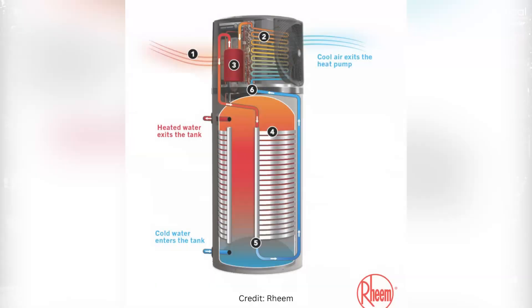A heat pump basically has four cycles. We've got a room-temperature refrigerant that goes into an evaporator — it goes through a tiny little hole, almost like squeezing an aerosol can, it gets really cold, and it gets warmed up by passing through a radiator, and now it's at room temperature. It then goes into a pump and gets compressed back into a liquid — that's a really hot liquid, a bit like if you've got a bike pump and you pump it up really hard, that bike pump's going to get hot quick. That hot liquid then goes around the outside of the tank and the heat gets transferred into the hot water, heating it up. Then it comes out at basically room temperature again before starting the cycle back through the evaporator, compressor, condenser — and the cycle keeps going.